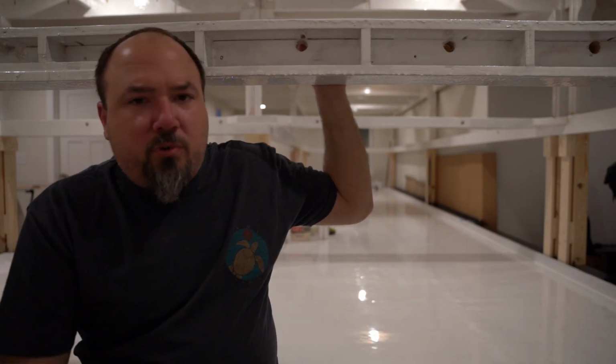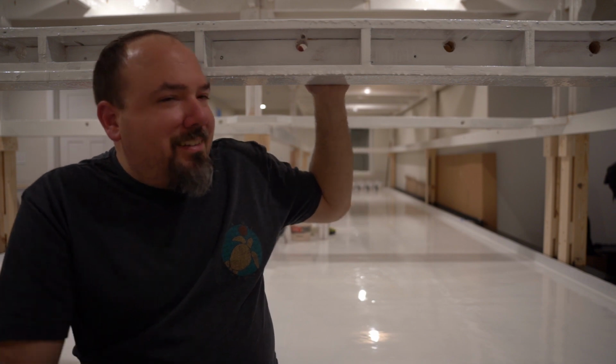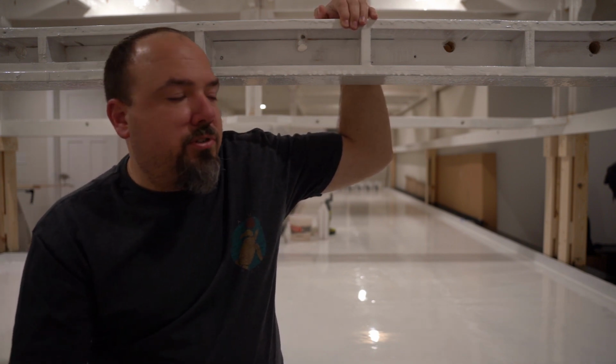They're just made out of 1x4 pine boards, and I didn't Pond Shield epoxy them because honestly they're not going to be exposed to direct water very easily, and they're all going to get covered with some furniture grade boards. So I'm not too worried about a little bit of splash or spill there. I'm more concerned about the structural elements of this build being protected, or the places like the canopy that are going to get that high humidity exposure. So that's why that still has bare wood on it. Just wasn't worth the time to apply epoxy to something that's going to get covered anyways.